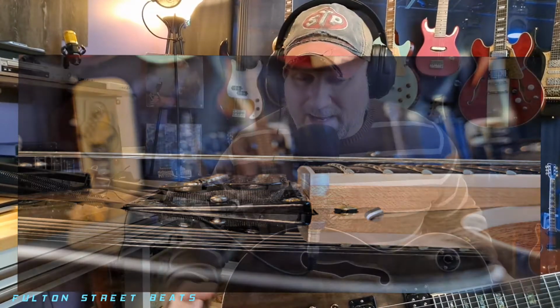So Billy from Guitar Kit World sent this out to me, and I was really impressed. I wanted to build a jazz guitar. I've never had a 7-string, and I said, well, let's try a 7-string. The first thing you notice about this guitar is this incredible action. I wish I could take credit for certain things, but the neck fit into this neck pocket so nice, and it was just a matter of a slight truss rod adjustment and getting the bridge height right, and it was there.